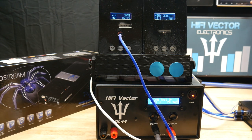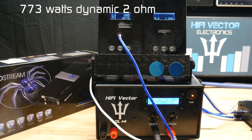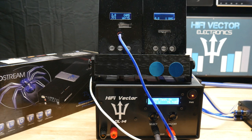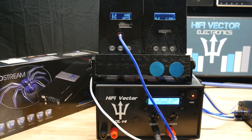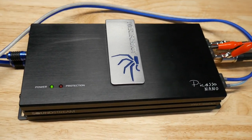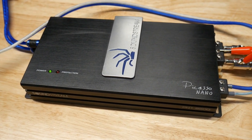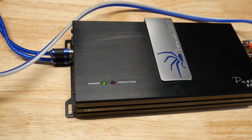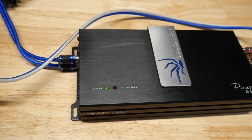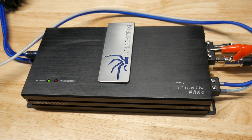Nice — 773 watts at 2 ohms! It definitely did over the 650. I'd say this is a total winner because even uncertified it did pretty close to the ratings, and dynamic it does more. So this is a great little amp — it did what it said, which is nice. Very well built, this is a Korean amp, so for the money and the build quality you can't beat it. It did rated power and actually more dynamic.